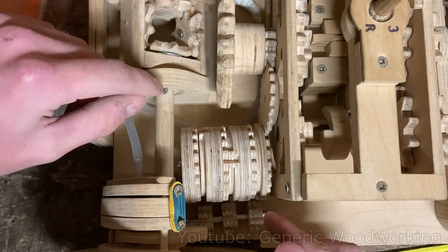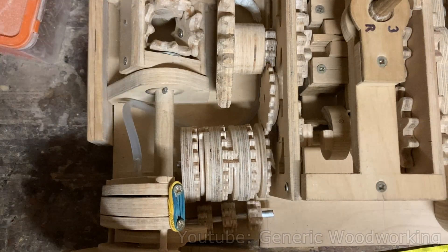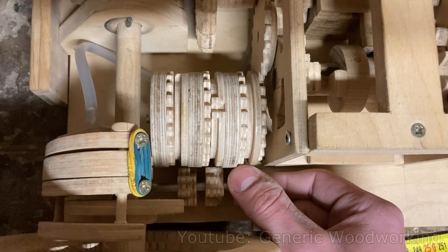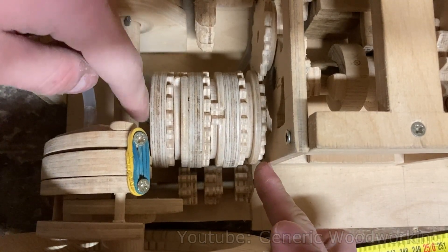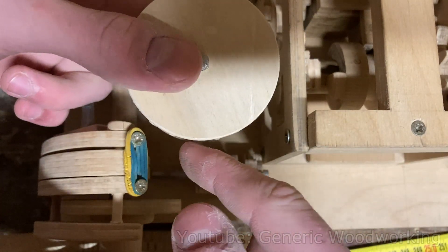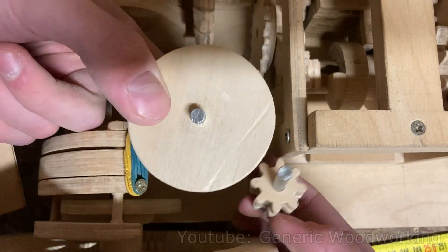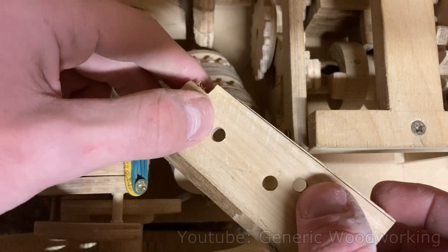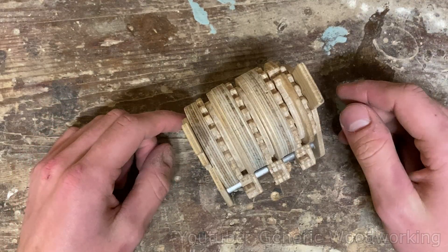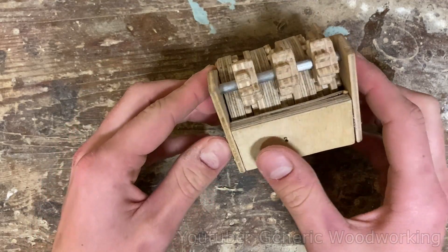Trying to fit this thing into place is a nightmare — I'm limited in space basically everywhere: by the drive gear, the rear axle, the brake caliper. But I think this is how I'm going to do it. I'm going to position this countershaft right here. I'll make two 4mm brackets to test fit these two pieces into place. I need to keep this part one centimeter off the ground, and the distance between these two shafts needs to remain the same as between these two mounting holes. I just made these two side plates and connected them with another piece of plywood on the bottom.